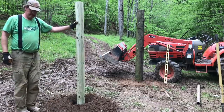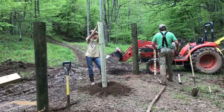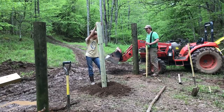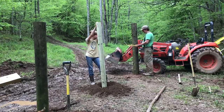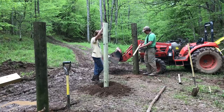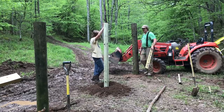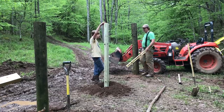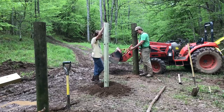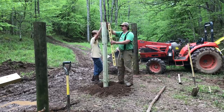Come hold this if you would. So what we'll do, buddy, is when we go to put the boards on, I'm not just going to nail boards to the outside. We want it to the inside, because if a boar leans against it, he's going to knock it loose. So if I just nail to the inside of this, then I don't have anything on the inside to nail here. So what I'll do is I'll take 2x4s and nail them vertically here and here. So the boards will actually be able to nail against the side of the 2x4s. So there'll be an inside here and an inside there. So you'll actually see a little bit of the pole exposed, right? So that, yeah, I'll take a reciprocating saw and cut that off. But that's why this 4x4 post needs to be inset, because when you have a board here, it needs to nail to the face of this. I'm not going to have it terminate on the side. So that's got it pretty darn close there.